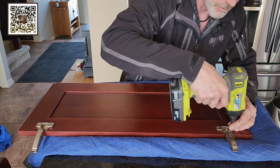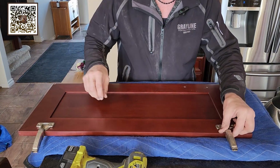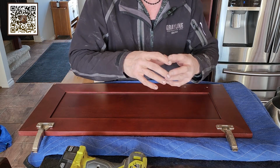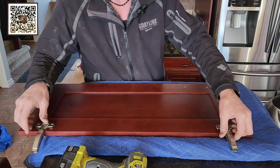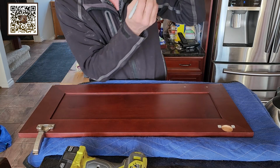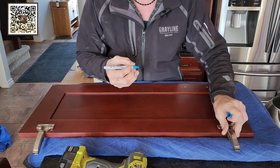And make sure when you're using a drill, just make sure that you don't torque too much. You just want to have a good feel of that connection with the drill bit and the screw itself, and then that's all good, right? But no, don't go start stripping screws. If you're going to do that, do it manually. Save everybody trouble.